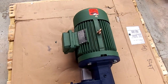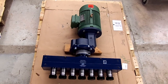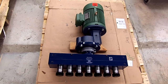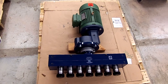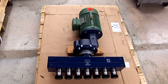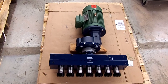The gear reducer is being driven by a five horsepower three-phase 230/460 volt motor. This entire setup will be put on a slide for a customer, and this slide will essentially perform a seven-hole drilling process in a fashion that an automatic drill normally would not be able to do — it takes too much thrust and too much horsepower to put this on a regular self-feeding drill. With the hydraulic slide and the motor and gear reducer, we get around that limitation.